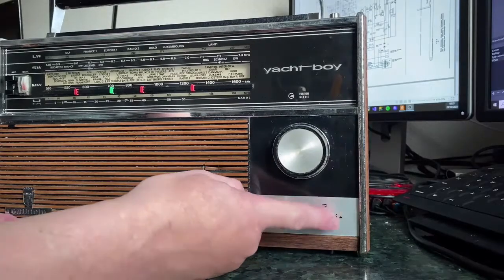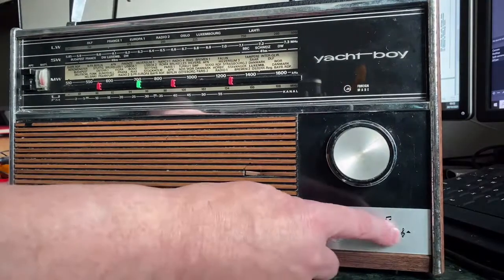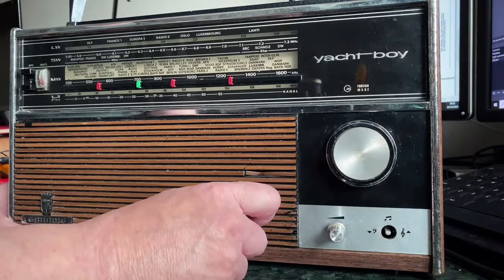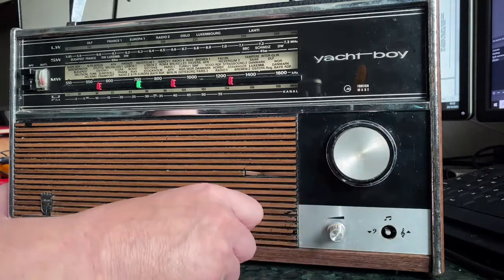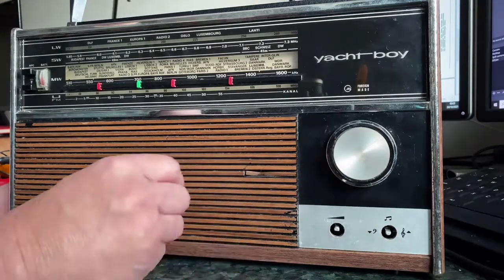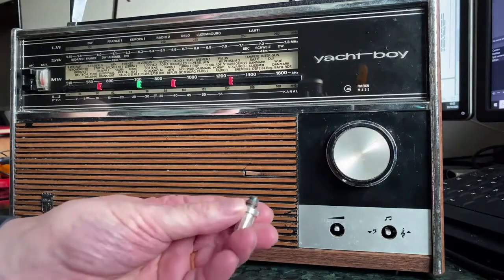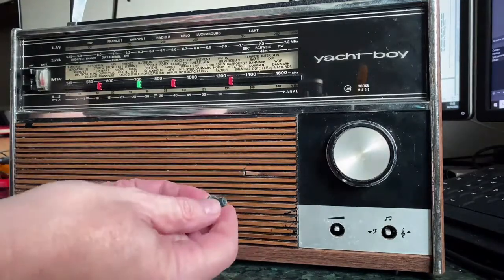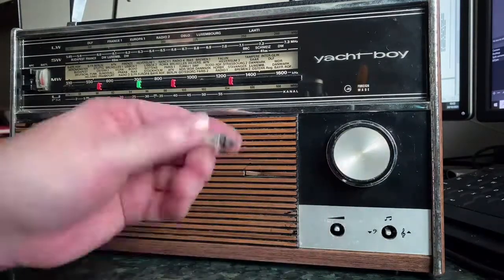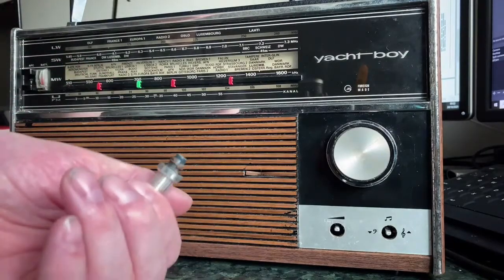this thing here, or this missing knob, I thought that would be quite easy to fix, but I didn't really look closely enough, because it's got the usual sort of D-type shaft, but they're usually 1/4 of an inch, and that one's a lot smaller than 1/4 of an inch. So I don't know where I'd get a knob for that size shaft now. I've looked around in vain for it. Also, it's not just that, but the fact that it's got this taper that goes inside there, so that the skirt can go on the outside, and so this is actually quite a custom thing, and I don't think it's going to be easy to get hold of another one.